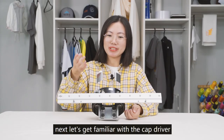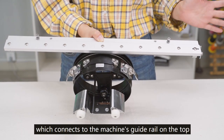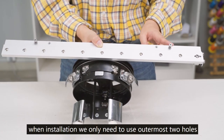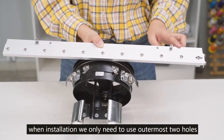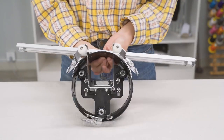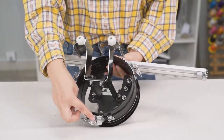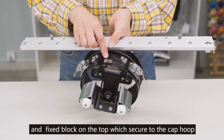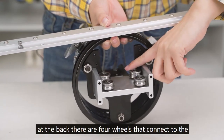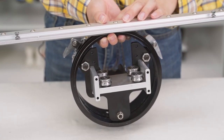Let's get familiar with the cap driver. The long strip is the guide rail that connects to the machine's guide rail. On top there are four holes; during installation we only need the outer two holes for the bearing's two holes, adapting for different guide rails. This is the stand of the cap driver with three latches and a fixed block on top that secures to the cap hoop. At the back, there are four wheels that connect to the guide rail at the bottom of the shuttle base, controlling forward and backward movement. Make sure there are no other accessories on the guide rail before installation.